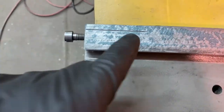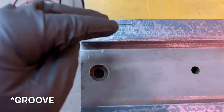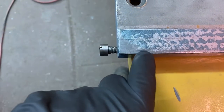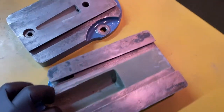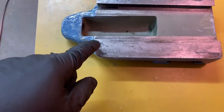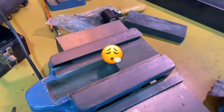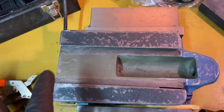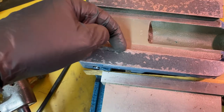I think I'm going to call it here on the bottom of this piece. Got pretty good coverage overall. I don't think that ridge is going to harm anything — it's just going to retain more oil. Wish it wasn't there but I'm not going to take it all the way down. I started on this piece — ran an ink once and my goodness it only touches there, there, a little bit there and there. I've gone round after round — it's picking up for most of it. There's still a little bit in that hole and along the edges, but overall it's fairly flat.